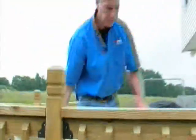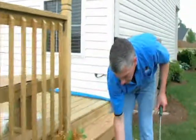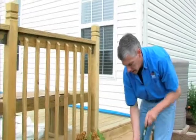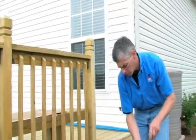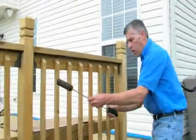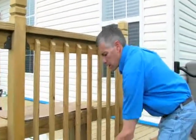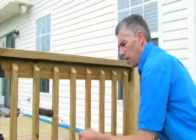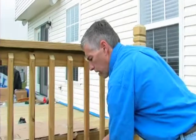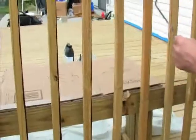I'm going to finish these out at the very top underneath this rail. Let's set this on a nice level area. You want to be pretty systematic about the spindles. To avoid changing my position, I've got some plants here. I'm going to get in a good position and do all the right sides of these from left to right. We talked about using a three-eighths roller to apply the material, so I am going to brush this in a little bit at the top and bottom where we don't get it with the roller.